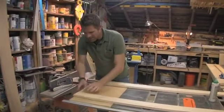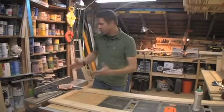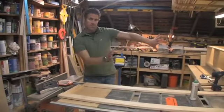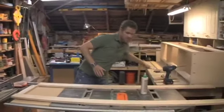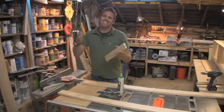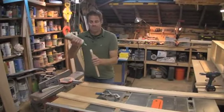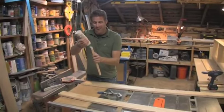Now, if you have a clamp table, you can clamp it right down to the table, but because this is a little longer, it's a little tougher with just that, so we're going to use this with a regular face frame clamp. With the Kreg pocket hole screws, you don't necessarily need glue, but I use it as backup, if you will. And when you're applying glue, you need to know how to apply it.